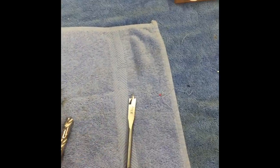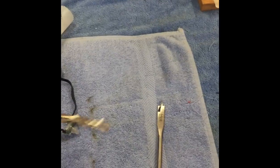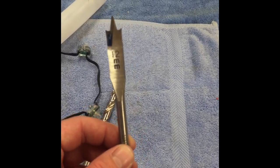Just one quick tip: I have used a 12mm spade bit compared to a 12mm flute drill. Once the flute drill goes in, it tends to pull itself in and drill right through. With the spade bit in the drill press you get just a little bit more control and a bit of a neater hole.